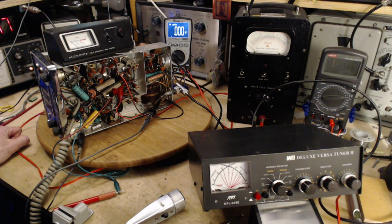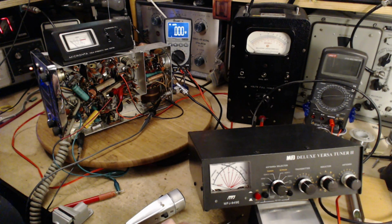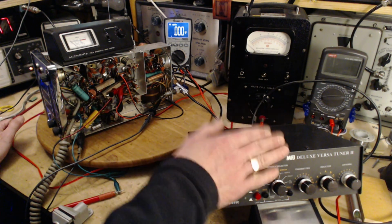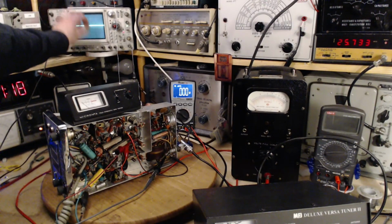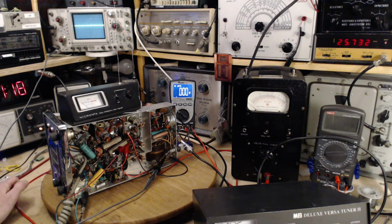Okay, so what did we find out there? We found out that the sensitivity on this reading isn't all that great, but meanwhile the output is going up and down like crazy. I have a fixed resistor here. So the problem is, if you just ramp up the output of this thing, you'll push the plate current of the PA beyond the 22 milliamps that the designers are comfortable with. Well, that's interesting. 7061, what is the typical plate current in a 7061? Let's check that out.